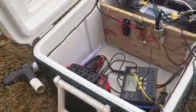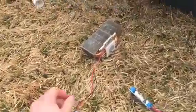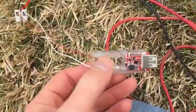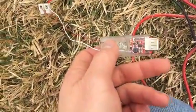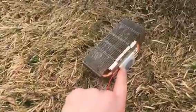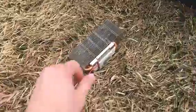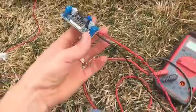That's one piece I've been tinkering with — that's just regular power in. This one is coming on to the Peltier, and this actually comes into a step-up that goes from two or three volts to five volts output, so I can actually charge my phone. The other side of this Peltier — this side is cold and that side is hot — that's actually charging. I put hot on this side using a torch, then put ice on the other side, and it actually worked to charge it.